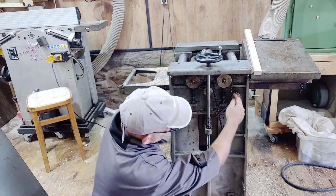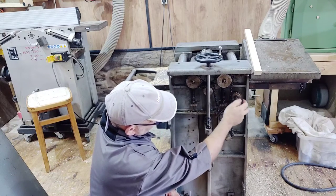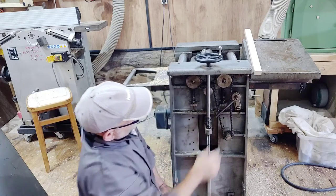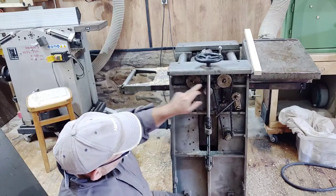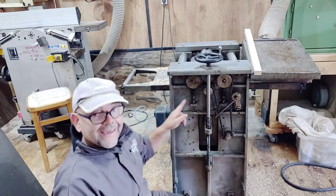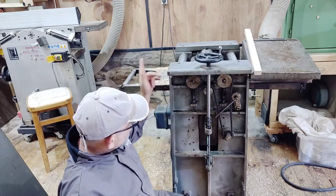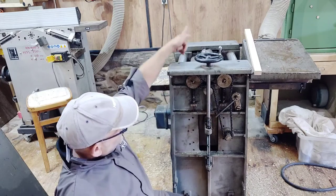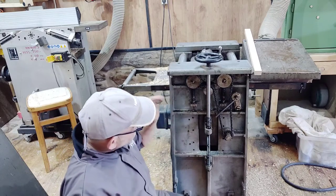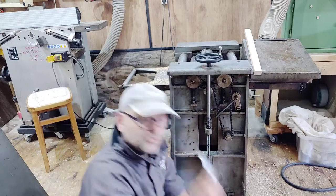Now that's tensioned by this tensioner, and these little guides here are on little bronze bushes, I think they are bushes, and they provide tension on the chain. So effectively, these two rollers are driven together at equal speed. But what we're actually talking about here is these two things here. There's one here, and there's one there, and there's one on the end of the roller on that side, and one on the end of the roller on that side also. Now all four of those have two lots of adjustments. There's eight lots of adjustment, and you adjust them using your spanners.